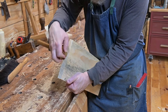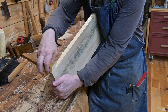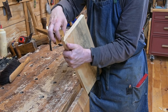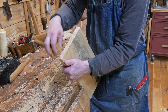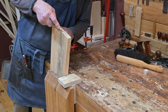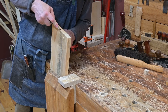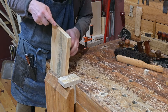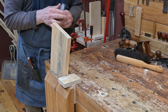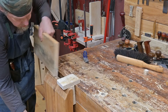And that process, of course, is called re-sawing a board. Next, deepen that scribe mark with a knife, making a slight groove — that allows the saw blade to easily follow these scribe marks. You can deepen all of these scribe marks now or just do the two leading edges for the first initial cutting.